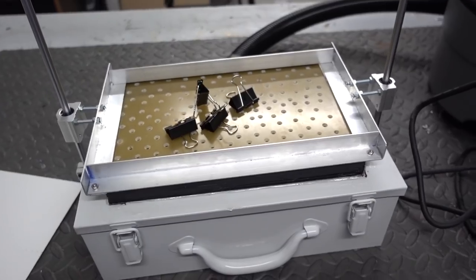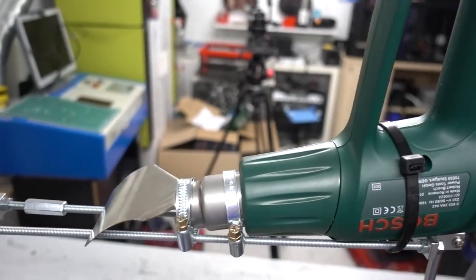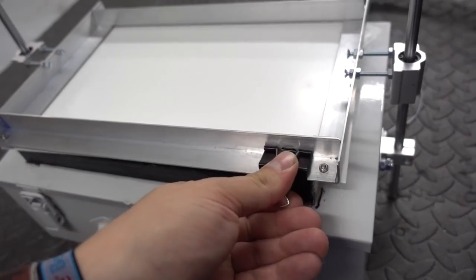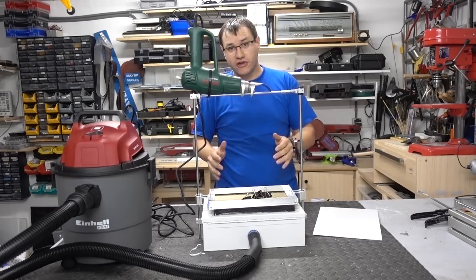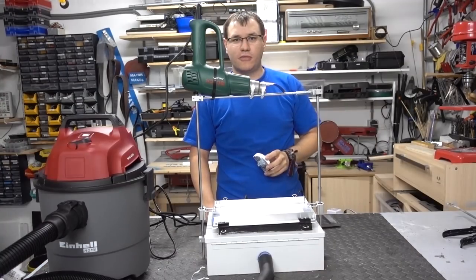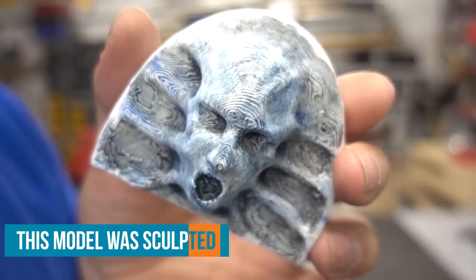The mechanical part is finished, now it's time for the first test run. This run will be done with a 1mm styrene sheet and I will control the whole thing manually so I know that it works. Then I will switch over to producing the electronics and get this thing somewhat automated. My test mold will be this 3D printed face — I printed it in PLA.